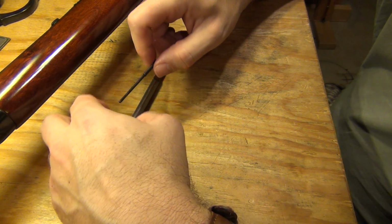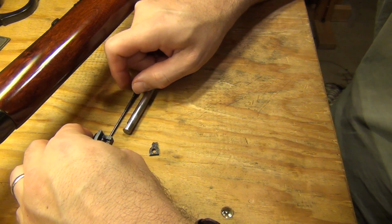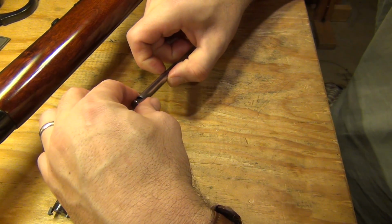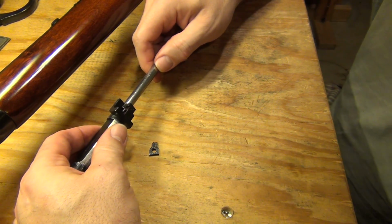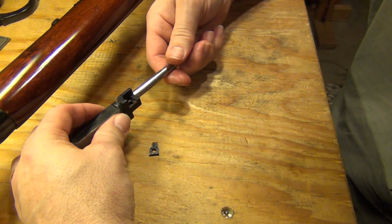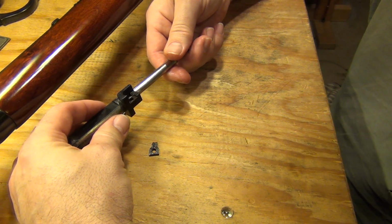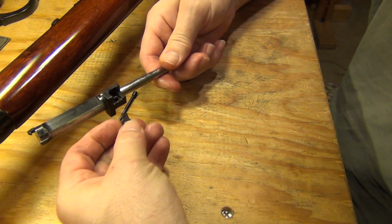It uses a spring to retract. What Uberti used to do was they had a pin that held the firing pin extension to the back of the bolt, and that pin would sometimes break. So what they've done now is sort of a nod to the authenticity, but with still using a firing pin return spring, which many people feel is actually superior.